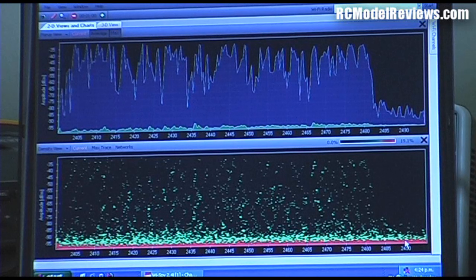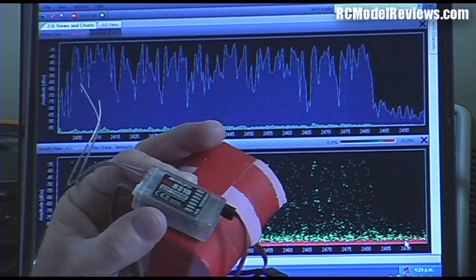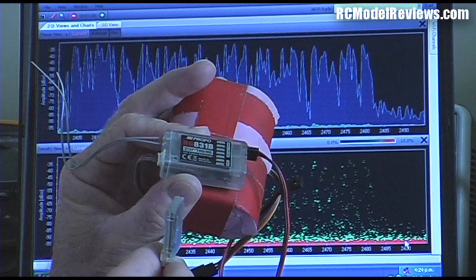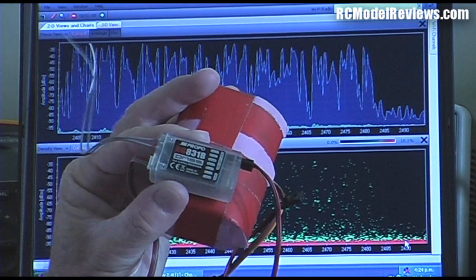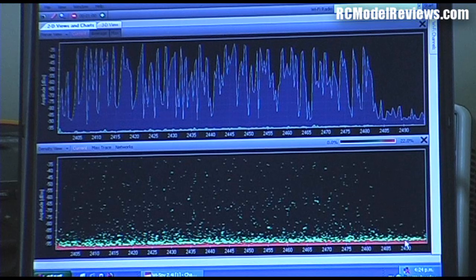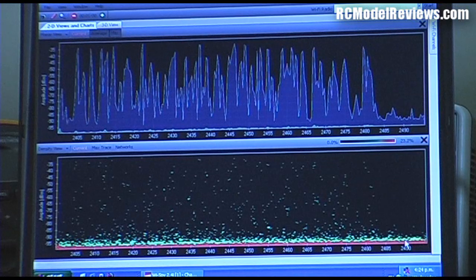...you'll see that everything starts to drop away. Interestingly, I'll show you this - it's quite pretty, a bit like Christmas. You can see the little lights in the receiver flashing away to indicate that the signal has been lost. This is the little telemetry transmitter, and this is the receiver with dual antennas. What I want to do is let the signal decay on the spectrum analyzer because I want to see what the receiver is doing - whether it's continuing to transmit after we've turned off the transmitter.